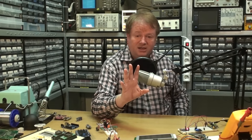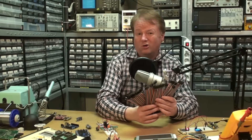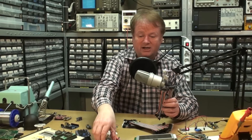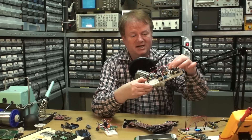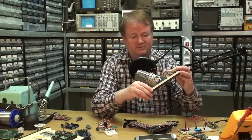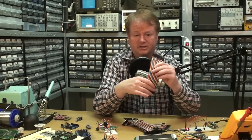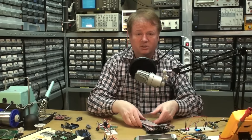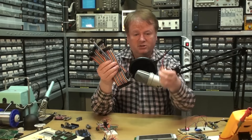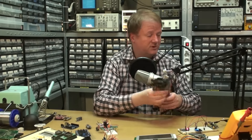One last word before we end — you may want to get these. These are so-called DuPont cables — I just call them breadboard wires. The problem with old cheap wires from China is they're very flimsy and can't transfer much current. These ones are much more robust and can probably run about one amp each. You won't need that for these experiments, but they're very handy and really cheap. You can get them with male and female connectors, and break them apart as many as you wish.